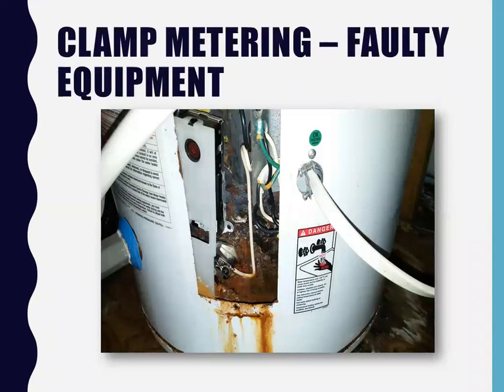I get these all day long, these hot water heaters. What happens with these things is they buy household hot water heaters that are steel reservoir. Sometimes they cover them with fiberglass, and the element that screws through the side of it starts to leak and gets rusted. And then it saturates the insulation, and the insulation is always laying directly on top of the circuit board that controls it.